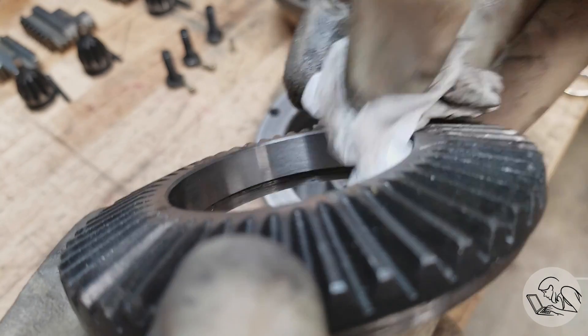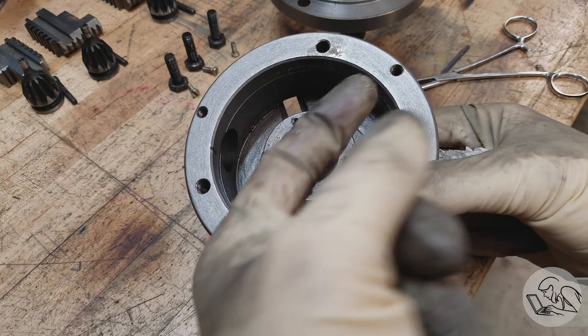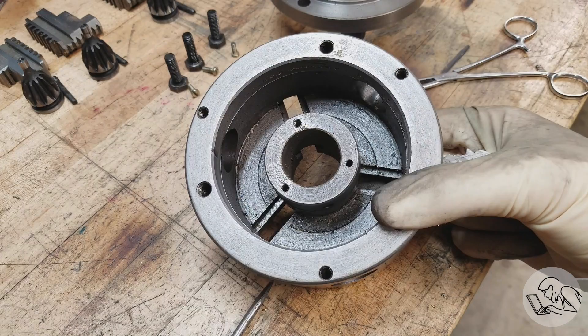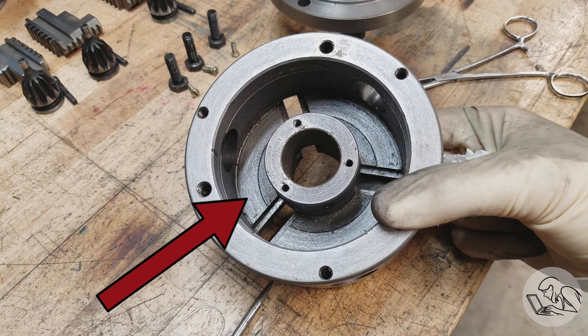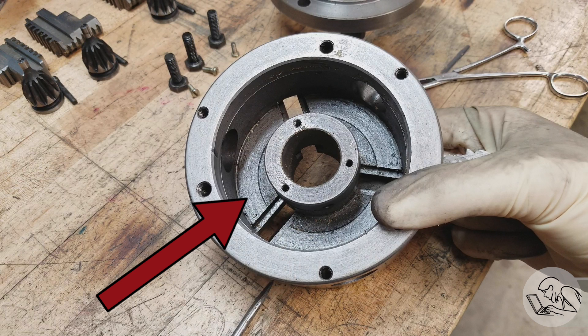Actually the grinding on the inside there is quite nice — that's a bearing surface, so that's good to see. In here there's definitely some grit that you can feel on your fingers more than you can see. This is really where you want to spend a lot of time focusing your cleaning, especially for a new discount chuck, as this is where there's likely to be grinding dust from the factory. The bearing surface on these is pretty primitive — it's just a step around the outside, and the machining on that is okay but not great. The tops of the scroll teeth are precision ground so they form the other side of that bearing, and this is cast iron so it's a decent bearing surface, but if you wanted to make improvements in a cheap chuck, this would be a decent place to start.